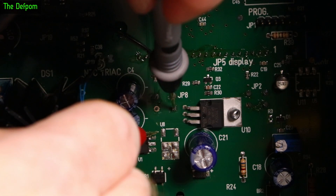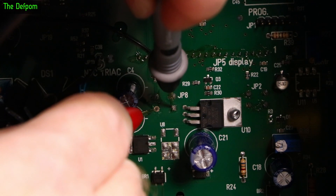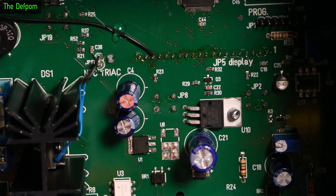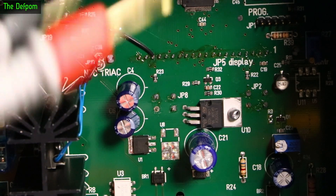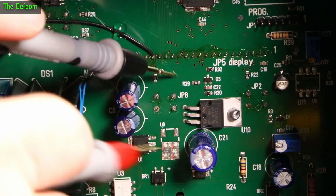The top pins go together. Going from there to here — if I touch the pad sometimes I've got nothing there, but touching the pin I do get continuity. It's a bit flaky. Yeah, touching the pad isn't getting anything but touching the pin is. So if I re-solder this it might be alright. Let's check if the switch actually operates by sticking the probes in and pushing the button.